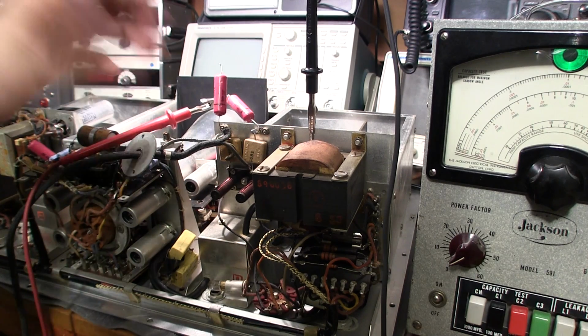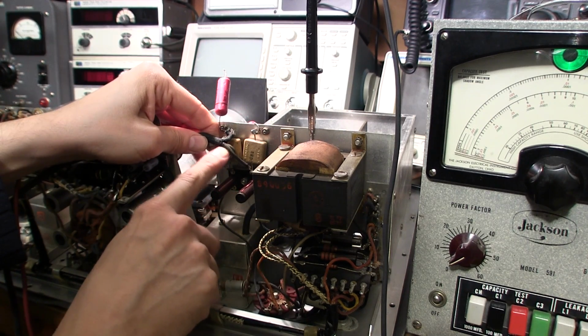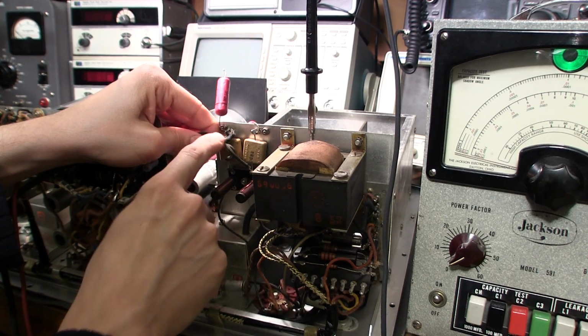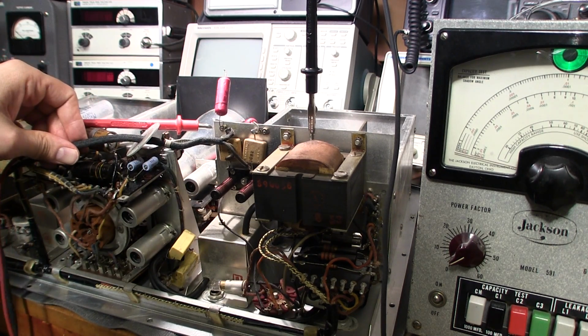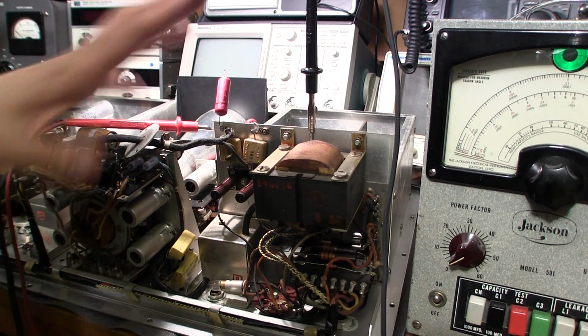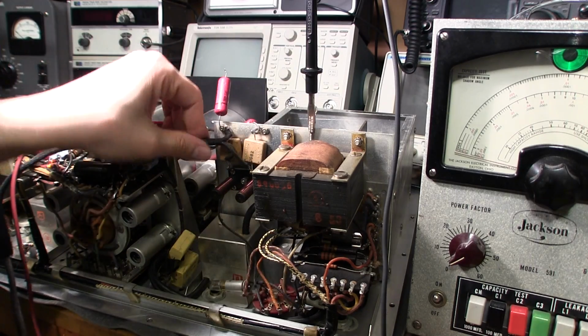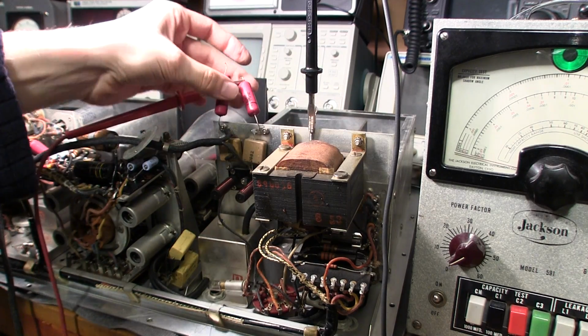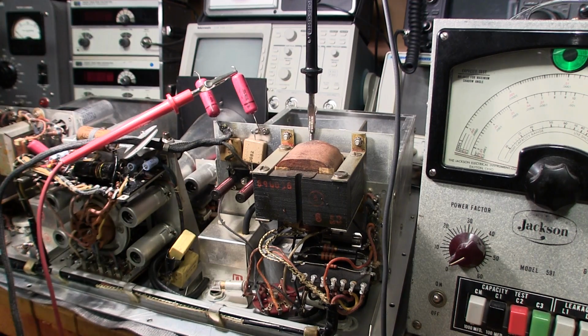But the problem is with this cord, it's going to probably have to go anyways because the cord itself is cracking here. So I'll probably have to get rid of this line cord. So unfortunately, I guess this shielded cable is probably done. Again, when it comes time to do the full restoration, we'll address this at that time. So pink Sangamos, horribly leaky.